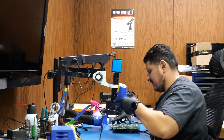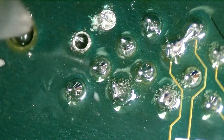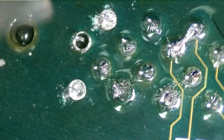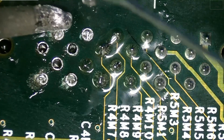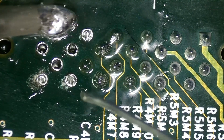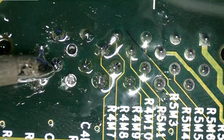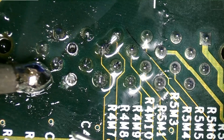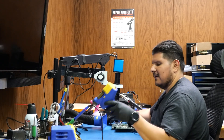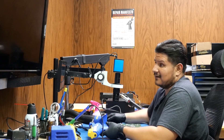So we have our guy ready here. That one's not going to clean up properly — may not have added enough leaded solder to it. I'll go ahead and add some more leaded solder to this area. As an alternative you can use some low melt solder, which I have here. I'm going to use some hot air. I've had better luck with the 1.0 and 1.1 consoles, but the solder gods are just not agreeing with me today.